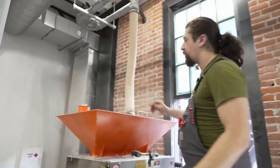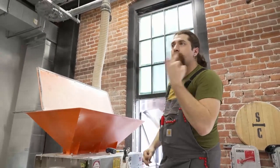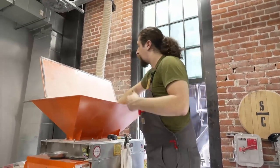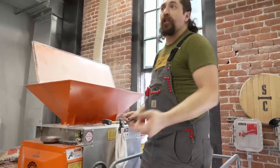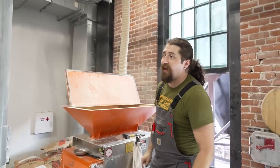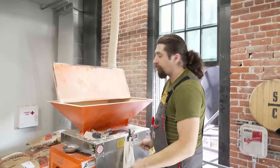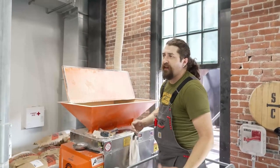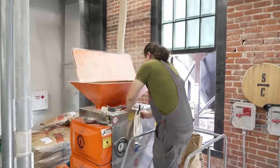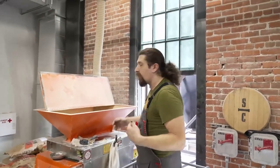We saw this morning kind of the opposite of what I'm worried about now — corn being big whole pieces, it's easy to have it not feed through fast enough. Barley, being softer than the just-dried corn, malted barley will feed through super fast and plug up the conveyance. So I'm going to pull the gate back a little bit more. Every grain is going to have a different feed rate that's appropriate for the system, so I'm going to dial this back some — I might open it up a little bit more depending on how it's running.